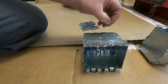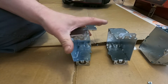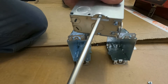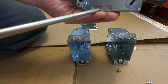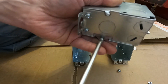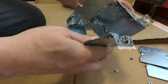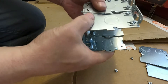You can also gang more than two. We'll remove most sides of a box — take a screw out of each side and slide the sides off — and that will allow us to gang three boxes together. So if you have three switches, you can gang three boxes together.